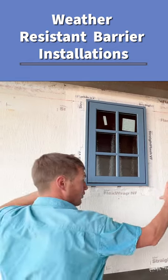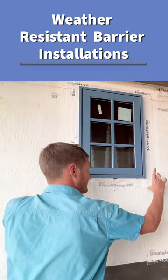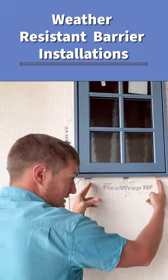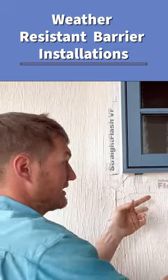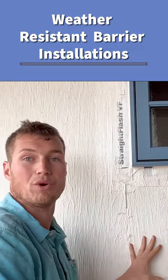We're also going to be mounting a wooden sill on here with wood trim down the jambs. When we put that sill on, we actually dado out the backs of the sill so that the weeping can get behind the sill, get back to the drainage plane, and work itself out of the wall.